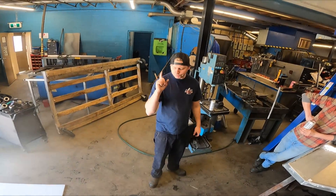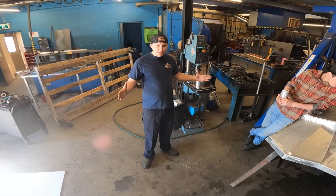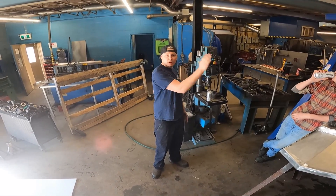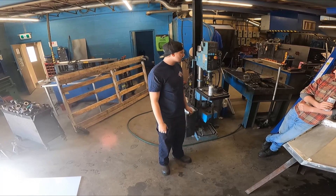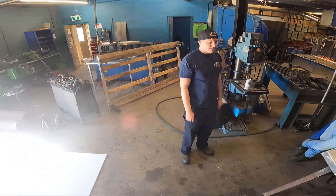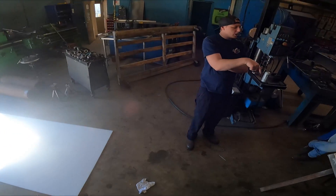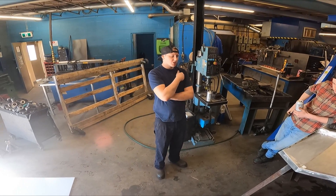I'm going to double check it and then we're going to lay it out. I'm going to lay out the intake from center lines so that it's all symmetrical. I'm going to lay out the front middle piece, draw a straight line for that, and cut it with a skill saw. Then I'll probably lay it up there because the intake will be cut out. We'll start drilling and laying out a couple of holes using the measurement that we took earlier.